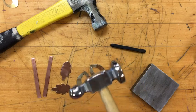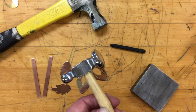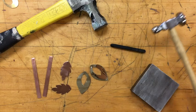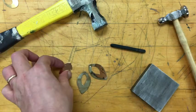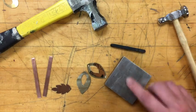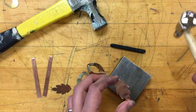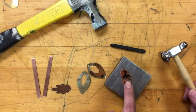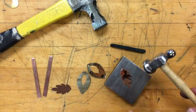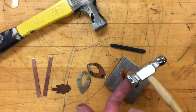These hammers in my workshop, whether at home or at school, only get used to planish rings or to create hammered texture. I have polished metal and a polished hammer, because any sanding marks on my metal — when I hammer it — get pressed into the surface, and I'd have a very hard time trying to polish them out without losing my hammered texture.